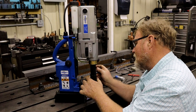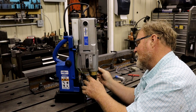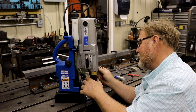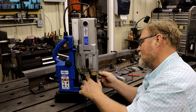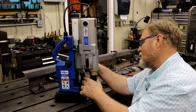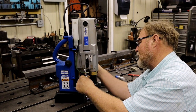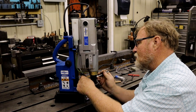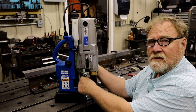The other night I woke up, middle of the night, thinking about a blue tool, and all of a sudden I remembered I had a blue mag drill. And if I were to take a center cutting mill bit and bore or mill that hole into that cavity, it would be a lot safer than trying to run a twist drill into it with a point. Mainly because I don't know what's underneath that surface.